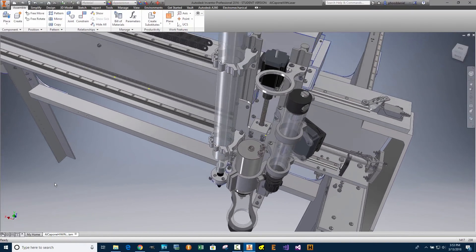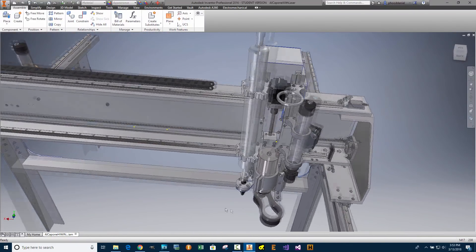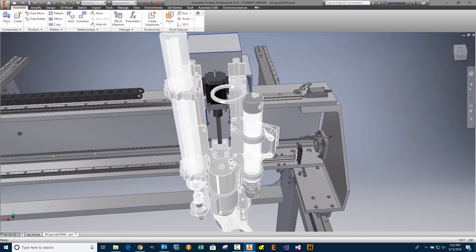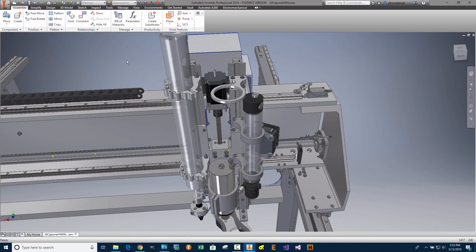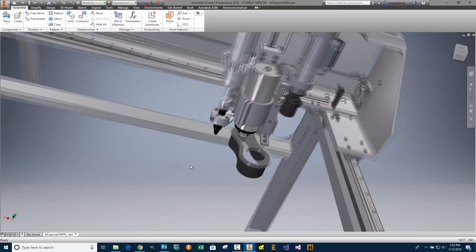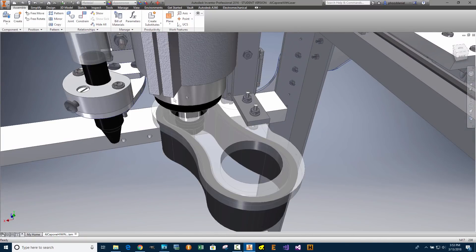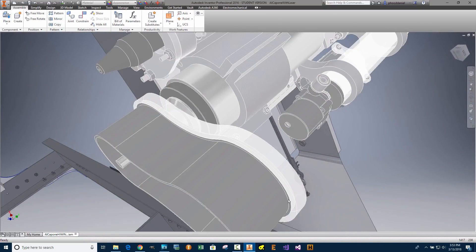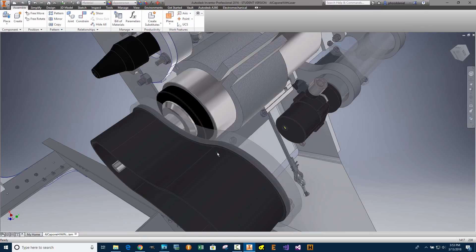We're putting together a Fabricator Pro for our customer and he ordered one with a laser. We already worked on the mounts in a previous video — I think that was vlog number one. Now we have to fabricate the dust shoe portion. The dust shoe is half-inch plexiglass and it has a groove around the perimeter that accepts a strip brush.